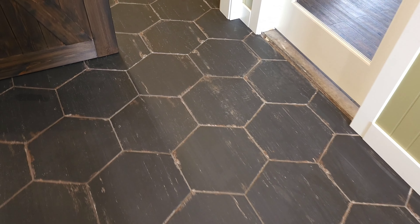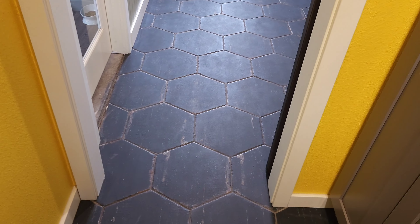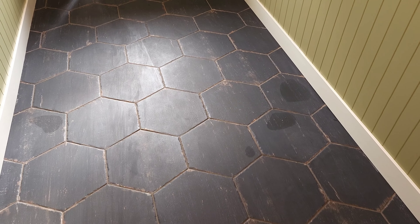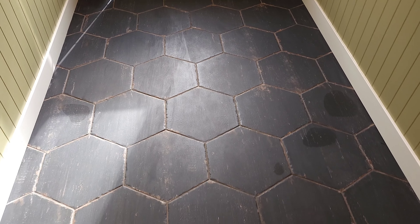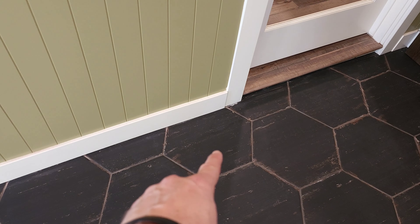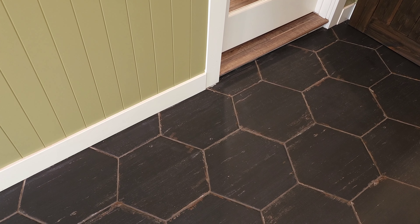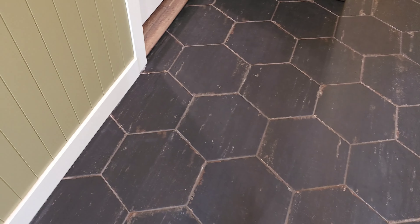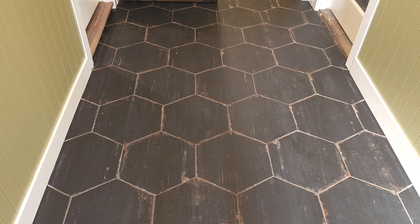So it's been stripped, it's been cleaned. It is still drying out in some areas — still a little damp here — but it all came off. It does look different in two different directions, so it just needs to be wiped down. This just needs to be basically a light neutral clean to finish it off. Out of curiosity, this tile here I stripped it — when I came to do an estimate I didn't have any acid on me, so I used a strong alkaline just to see if that would pop it. It did get stuff off the surface but only like dirt; it didn't do anything for the drywall dust that somebody caked into the floor. So it's a little harder to do because it's an unglazed tile, but the acid cleaner and the stripping pad with the buffer is what did the trick.